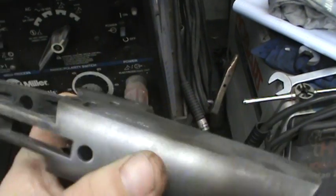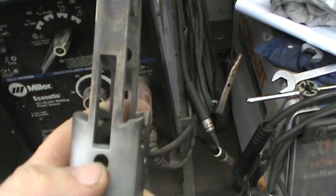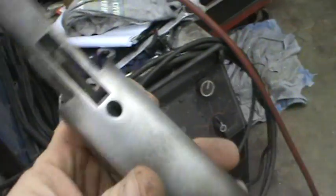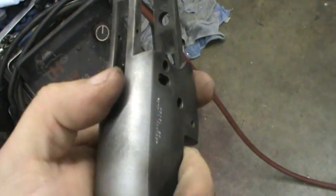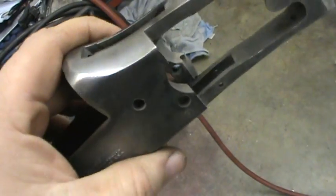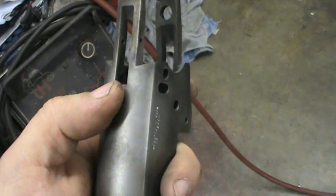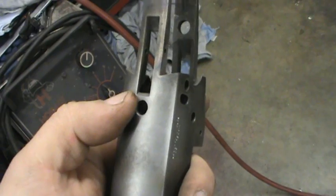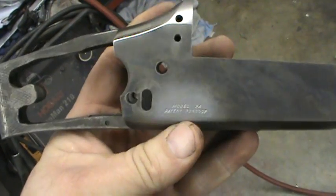When I start welding, I'll do one circle around it real quick and get off it for about 10 minutes — try not to overheat the frame of the gun, cause it causes distortions and warping, and there's no strength really needed here, it's just there to hold a trigger guard on. I'll go over the TIG welding, then TIG it, wait 10 minutes, and TIG it again. I won't video all of that — I'll show you right before welding and right after. That should be all I'll get done today.